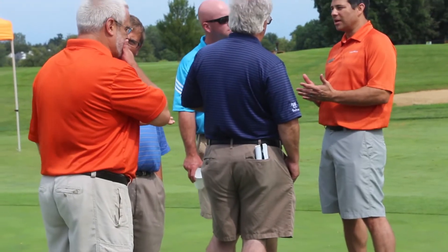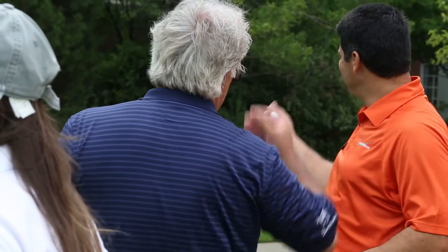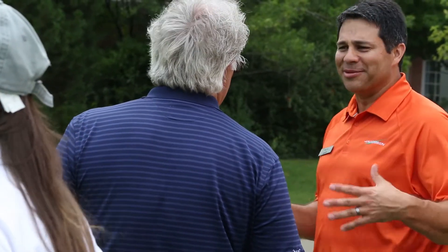FOC is a measure of distance from when one reel blade passes over the bed knife to when a second one does. The three inputs into FOC are your walk speed, your reel speed, and the number of blades on your reel. Making sure superintendents have a good understanding of how those three inputs impact their FOC and how changing them will affect it.